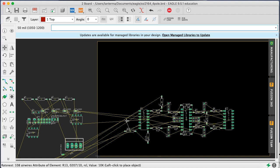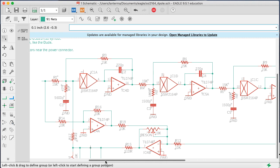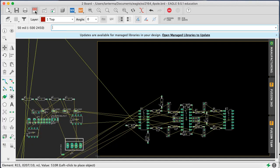And it wants to go to pin 6 here. Oh, we might wind up doing something like that. We'll see how this goes. Okay, let me put this here for a second. And then what do we have in the feedback loop? Or actually, what do we have coming out? So we have coming out, it has R15. So we'll put that in pin 7. Move R15, goes to pin 7.